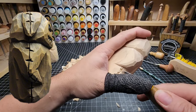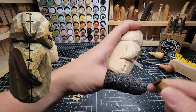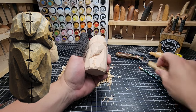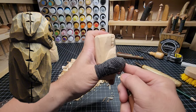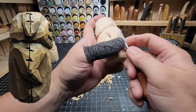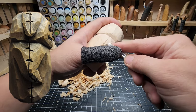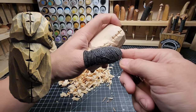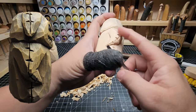Same thing over here — match them up. And that's all we're doing. It is significantly easier if you have a V tool. Because with the V tool, you can just carve that line really quickly, all the way down to the tip of the hand, and then put in one, two, three — putting those stitches in. So much easier than just using a knife.